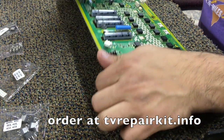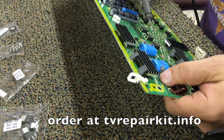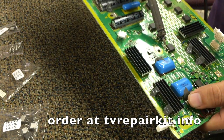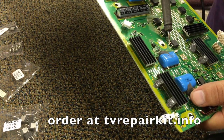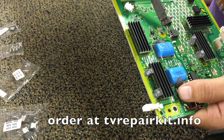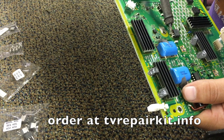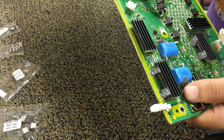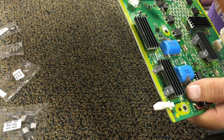On this board I marked all the chips beforehand — that way I could just take them all off first before starting. With these surface mount transistors, all you have to do is heat up the leg and pull them up. I'm going to do that first on the four components that are like these.